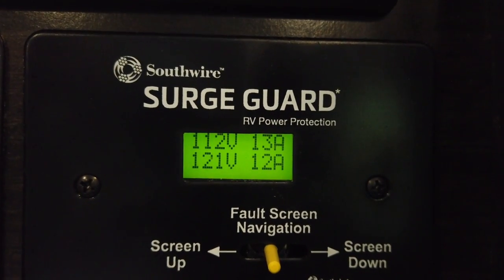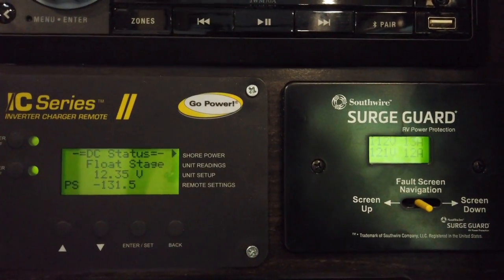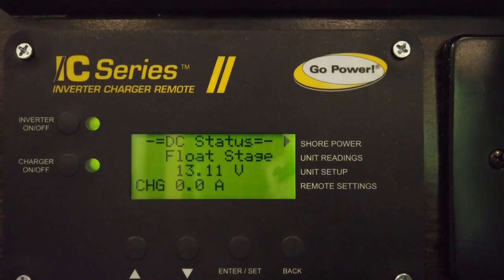If I want to turn on something on line one right now, I can do that — let's try the microwave. You can see we've got 13 amps on line one and 12 on line two, 25 amps total being pulled. Tara's going to put her coffee in the microwave and we'll fire it up. You'll see the inverter kick in and supply the rest — we're still only pulling 13 amps on line one from shore power, and the inverter is supplying the rest to run the microwave. Kill it now. You see the inverter drop down and go into charge mode. We were able to effectively pull more than 15 amps from line one because the inverter kicked in.